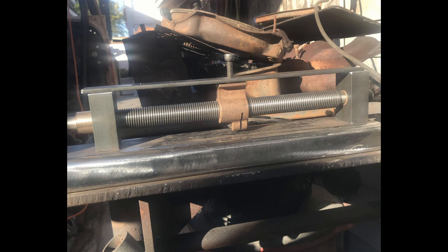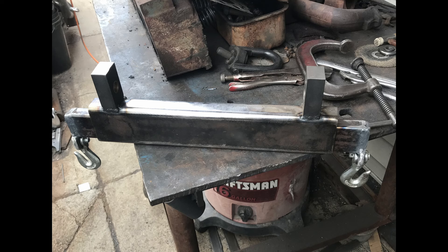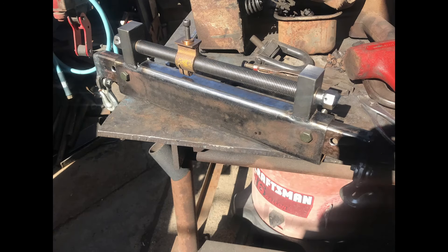This shows some inch-by-inch-and-a-half material, about two inches long - I trimmed these back later. This is the setup for the lead screw. I had some bronze bushing or bronze bearing material, and that's what I turned this bushing on the end out of. Here it is set up and started in the weld, with the brackets welded on. I made sure I had good alignment for the lead screw so it was free all the way through - I did go back and open up clearances at one point. There's the other piece of tubing cut in half with the brackets for the hooks.